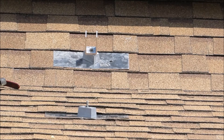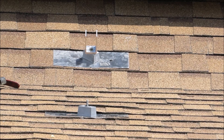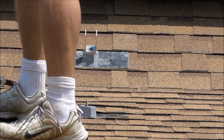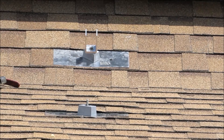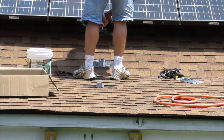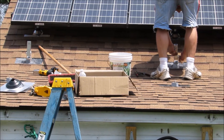We're going to do some trimming and cutting on aluminum to get close to a 53-degree angle, which would be great — more winter time and more summer time power, all year round. Kind of get a happy medium all year round; that's our goal. Everything I got came from Alt E, the Alt E store.